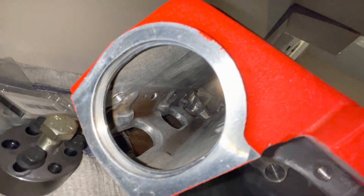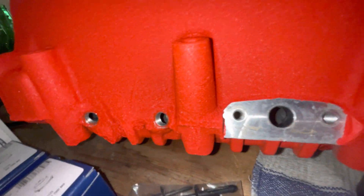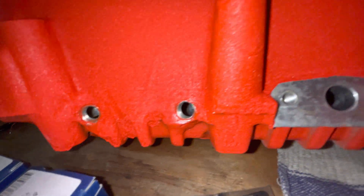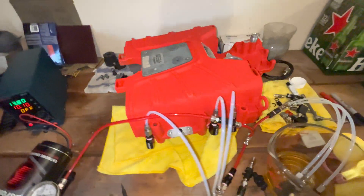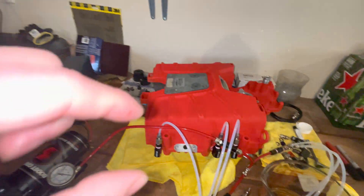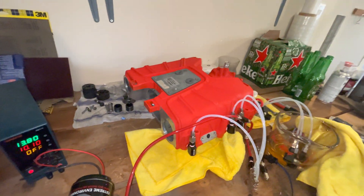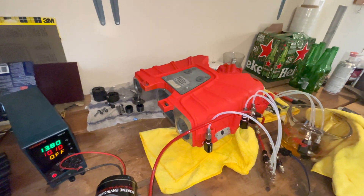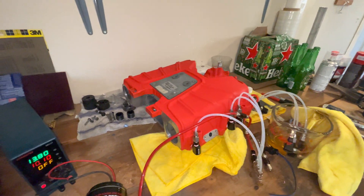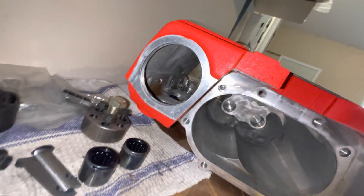We do have the same setup going on the other side. So I did the drilling there and you can see the other two here. I did have to install some threaded coils in some of them basically because of the angle I was on - it didn't allow for a good bite for the tap. So I just drilled it again, put a threaded coil insert in there, and put a sealant around so it wouldn't leak. So they're in there in some of the ports that I had issues on.